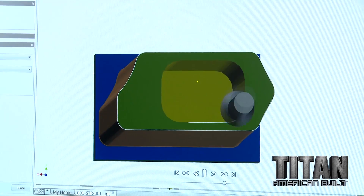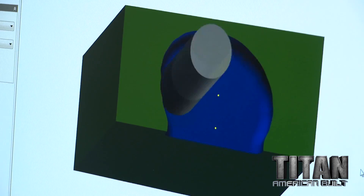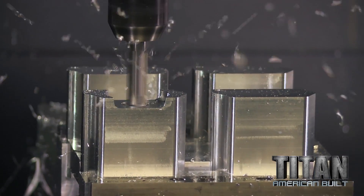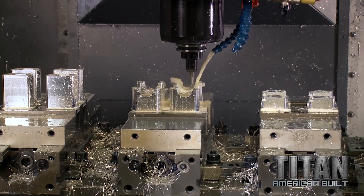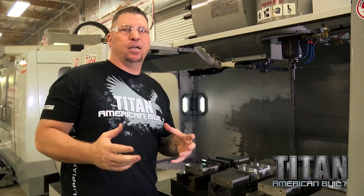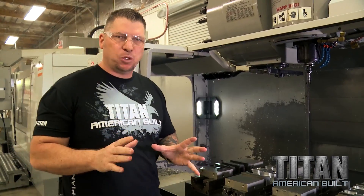The two different parts in the first vices are getting profiled and cut. The second side is super important — it's got this 3D ball track surface to get a super smooth, nice finish. This 3D surface, when the assembly goes together, it's going to be calibrating the whole fixture. So the plan is to run both parts that are assembling together at the same time.